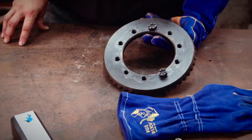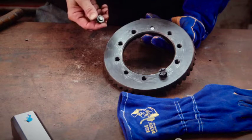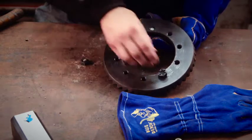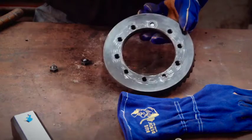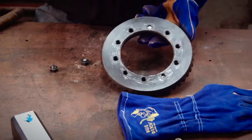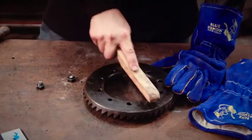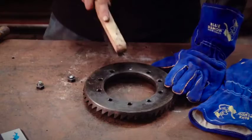A common problem in the automotive industry are broken bolts and ring gears. We've simulated this, but it's an actual thing that happens. We have two broken bolts — one's a little deeper than the other — so you'll be able to see as we build that material back out and weld our washer and our nut onto it. One of the first things you need to do is clean the area you're going to weld with the wire brush. Try to get all the contaminants and oil away from the area you're going to weld.